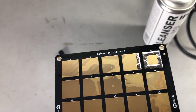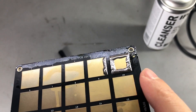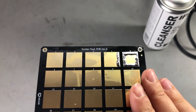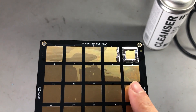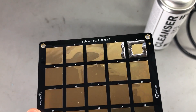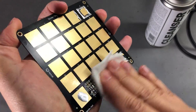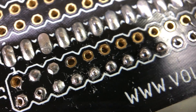Using these methods you'll notice that if you don't wipe the boards clean at the end you're left with residue which is clearly visible on the solder mask. Having a compressor and blowing that excess alcohol and flux away from the board will help, but as a hobbyist it might not be possible to operate a compressor in an apartment. So the next best thing is to use a paper towel and wipe the isopropyl alcohol and take as much of the flux residue away from the board.